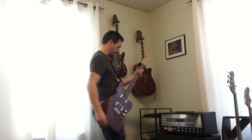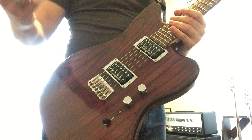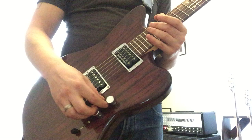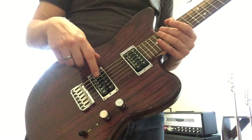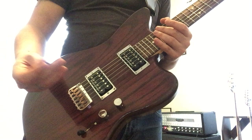So yeah, those are the quick tones. Pretty basic setup: two humbuckers, volume, tone, three-way switch — doesn't get any more straightforward. Except there's a totally cool thing: the volume knob, when pulled out, splits the neck pickup. And the tone knob, when pulled out, splits the bridge humbucker. So you can have either in single coil mode, or both, or just go straight humbucker.